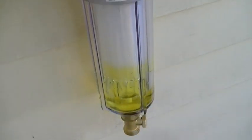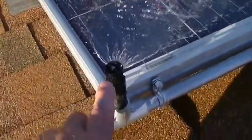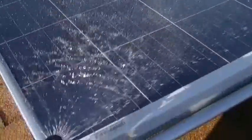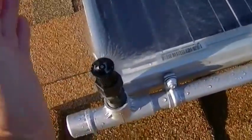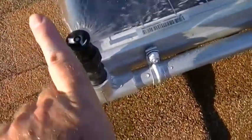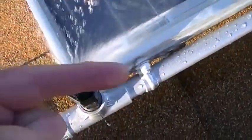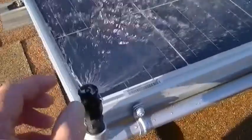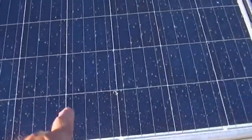The soap cycle has started. I tried the VAN 12 on the ends but put the VAN 15 back because it wasn't quite reaching far enough. You can see I've got the spray aimed slightly to the side because the volume of water is in the center and there's only a mist at the edges — so I angle it so that the heavier water volume lands on the edge of the panel. Same adjustment at the top — the main water should land on the panel edge. You can see the soapy suds.